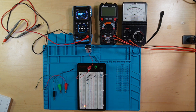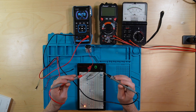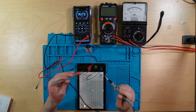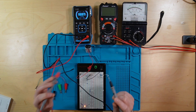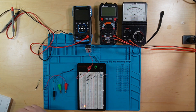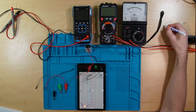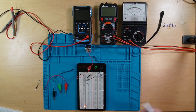For the purposes of the experiments we're gonna do, we need to get a baseline voltage of what our battery is. Since we used it already, saying it's 9 volts is kind of misleading. So as I've got it hooked up, I'm just gonna read 8.889 volts. So as you can see, it's dropped a little bit. I'm just gonna write this down: 8.889 volts. Let's remember that.